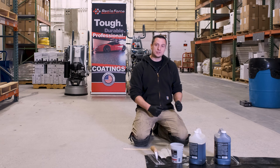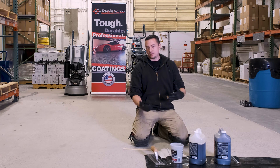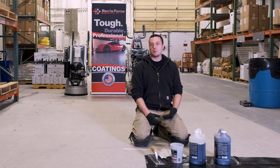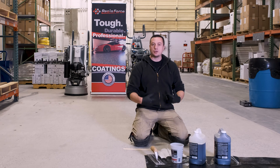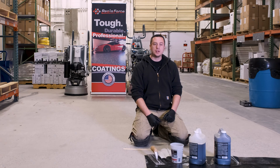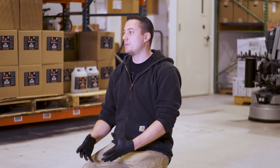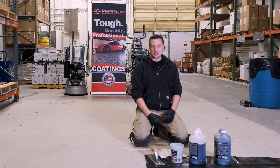If you're going to do it for an epoxy floor system you're typically going to use your MVB, which is going to be your moisture vapor barrier, which is your prime coat. You're going to grout coat the floor with that first and then use the same product a couple hours later to roll out your full membrane for your moisture vapor barrier. Using the same product will maximize the adhesion, the bond, fill in the pinholes, minimize outgassing, and give you a better system above it with the least amount of bubbles as possible.